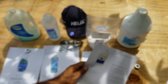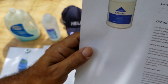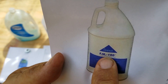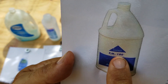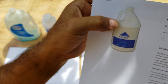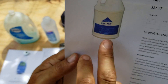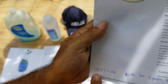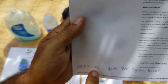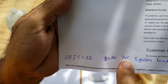Lastly, we have the Drexel, which has been my number-one foaming agent for making aircrete in my humble opinion. The label shows FM 160 — that means you can make 160 gallons from one gallon of Drexel. To make a 5-gallon bucket using Drexel and get the very good, stable foam that I get, it requires only 4 ounces. There are 128 ounces in a gallon; divided by 4 ounces gives me 32 five-gallon buckets per gallon. In the end, I'm paying about $0.86 per 5-gallon bucket.